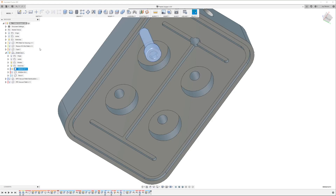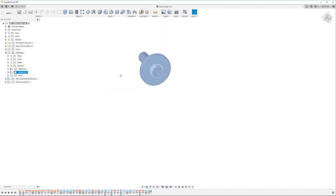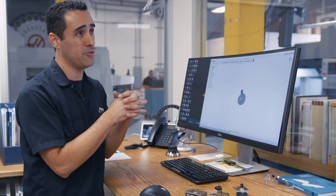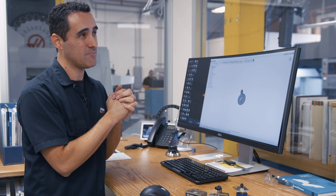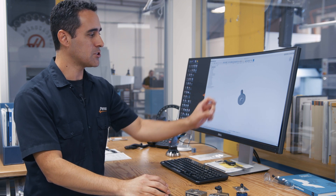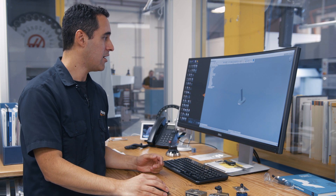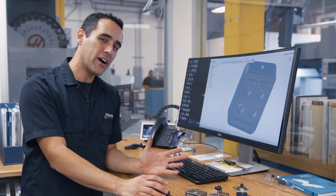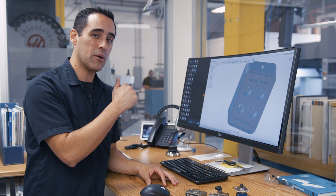Let me show you one more thing. My first inclination was to go with the standard socket cap screw, but then refining that idea, I found this type of cap screw — it's got this huge diameter head. Look at this thing. That is one single piece; I've never seen that in a hardware store. I'm definitely going with that because it's going to give me lots of good surface area. I'm going to machine this out of HDPE — easy material to machine — and it'll give me a lot of surface area for sealing on the vacuum area without having to deal with O-rings. We'll find out. Let me program it, machine it, and see how it works.